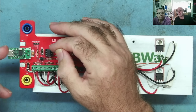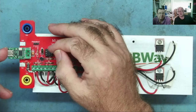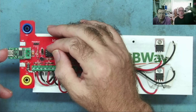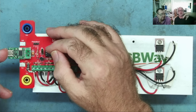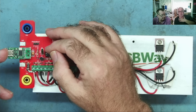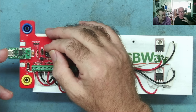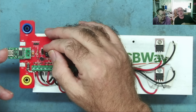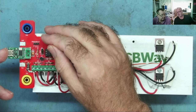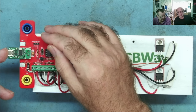But then we were clever and thought, okay, we can do better than that. Because if you go for 3 volts, you have 0.03 volts left in the resolution of the ADC. And we thought, okay, we can go down to 1 volt. And if we go down to 1 volt, we have the full resolution. The ADC has a setting that we can go for 1.1 volt, and this is what we're going to use for the ADC here. So we were going for a very strange combination.